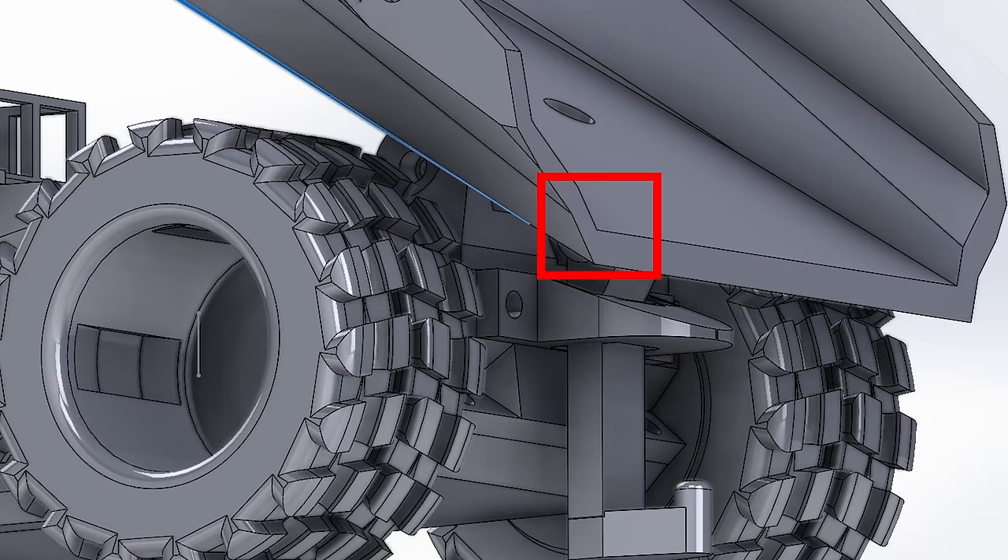This is what we ended up with — just look at this beauty. Basically, the trailer comes into place, the hitch pulls it up, and this little arm gets trapped under the hitch support. As it gets trapped, it gets pulled down, which pulls the leg up and out of the way. I've got a little counterweight so that it always falls back down, and the leg itself is pretty heavy. The ultimate test is actually loading the Mini Skiddy onto the trailer. I made these little diamond-shaped extrusions that are pretty grippy and the Mini Skiddy can climb up on. It takes a fair bit of practice to get it to go up straight, as it likes to hop around.